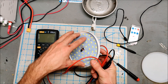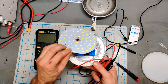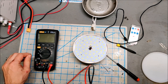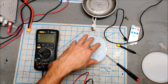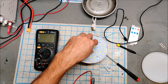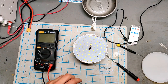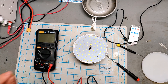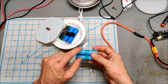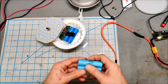I wonder if I can get a third 18650 in there, but I'm probably pushing my luck, so we'll do two 18650s. We'll spot weld them together, solder on the leads just like they are in there, and I think we will triple the capacity. These are both 1,000 milliamp 18650s, so there's 2,000 milliamps total. Here are two LG 3,200 milliamp hour batteries salvaged from old Lime scooters - I keep hundreds of these in stock for all my projects.